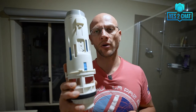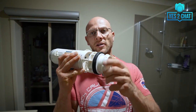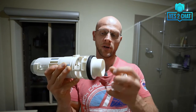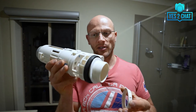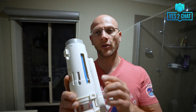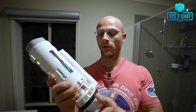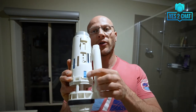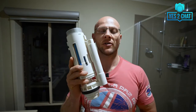The last thing is this nut which you can unscrew — there is also a rubber washer and another plastic washer which we will be installing onto the cistern. Now when you've made your adjustments and selected how much water you want for the full flush, half flush, and total tank usage, you are ready to install the flush valve back into the cistern.